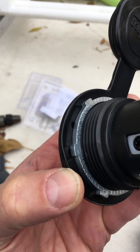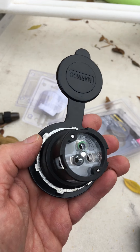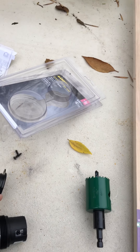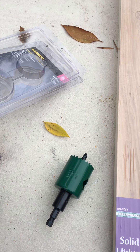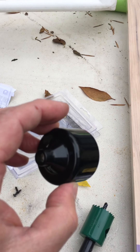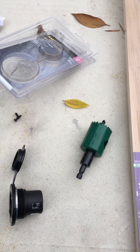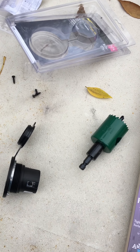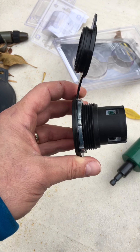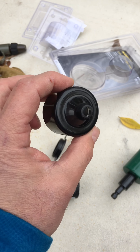It's got some threads here in case I want to tighten it up with a metal ring from the inside, and it's got the connection ports clearly marked, plus a cap that goes over the end. I've got an inch-and-three-quarter hole saw — it calls for inch-and-seven-eighths so the threads can clear, but the cap diameter is about an inch and three quarters, so I'll drill to that. Since the trailer wall sheeting is so thin, I'll use a Dremel to open it up slightly if needed to let the threads pass through, and that should allow a nice tight fit on the plywood inside wall.